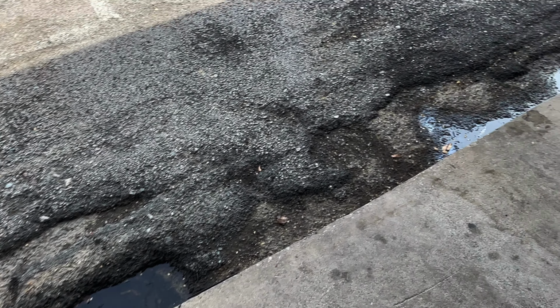I had to cut a straight line through the asphalt since we weren't taking all the asphalt out, just this section. I used a concrete blade which cut through the asphalt pretty easily. Didn't even really make much dust.